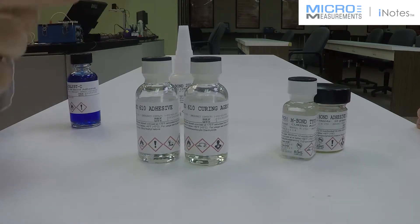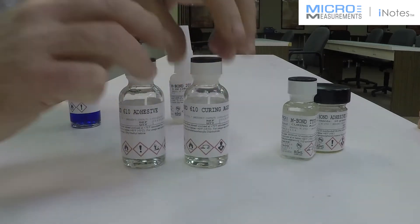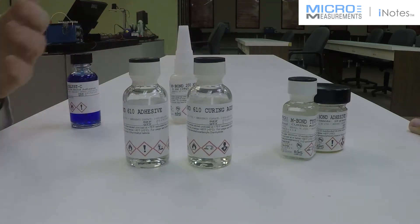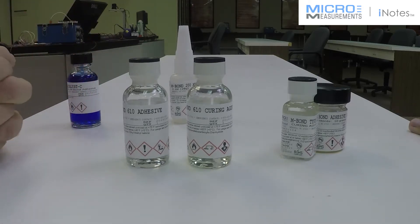You could. However, the AE10 and GA2 are limited to around 200 degrees Fahrenheit, while the 600/610 adhesive systems are rated much higher. So if you're within the temperature range of the AE10 or GA2, certainly you could use this on top of it, but it would probably be a redundant component — something overqualified for the job.